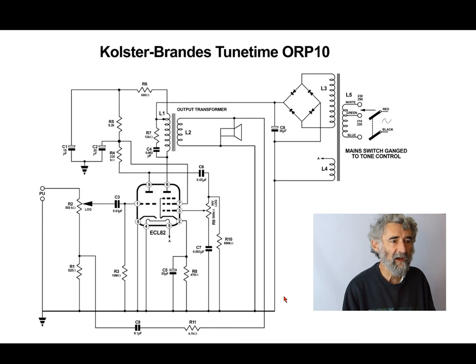Negative feedback is applied via a 4k7 resistor and a 0.1 microfarad capacitor. Taking the ratio of 4k7 to 820 ohms, it's somewhere around 6 times, so a sixth of the voltage is fed back from the output. But the reactance of this capacitor over most of the audio frequency range is going to be higher than the resistance of the resistor. So this is essentially a built-in treble cut circuit — there is a lot more negative feedback at high frequency than at low frequency, and at the bass end there is basically none at all.